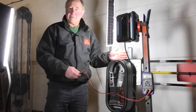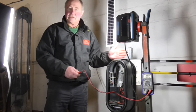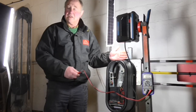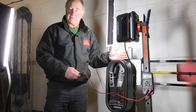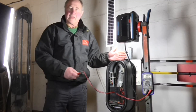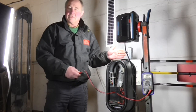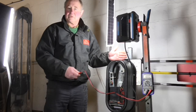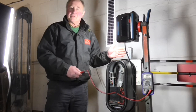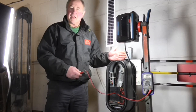Secondly, if there's any doubt about a battery — you've just charged it, put it on the gate, and after two or three days it isn't working well — the battery needs to be replaced. It will save a lot of trouble in the long run. A new battery will keep this gate going for well over a month without much solar help, so if it's only lasting three or four days, the battery has had it.